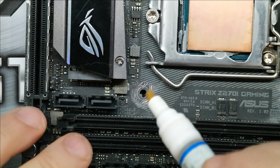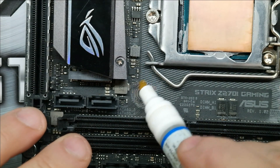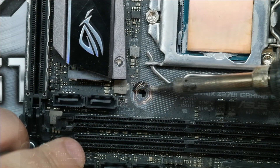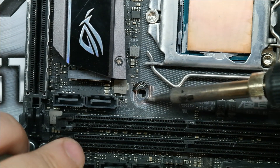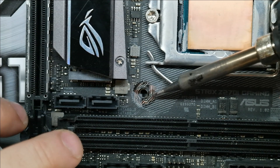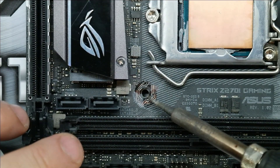What I'm going to attempt to do is, up here where the traces look beat but not completely gone, I'm going to tin them and see if that helps refill them. So this is just a little bit of flux. That looks a ton better now. I'm not sure if I can tin this one — let's give that a shot, because it looks like too much of it has worn off. The differential pair that's sitting right here tinned nicely, but that one didn't, so I'm going to have to do a further repair to that.